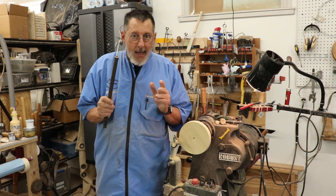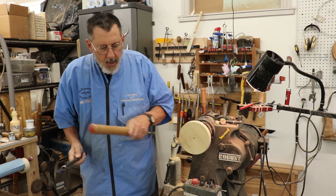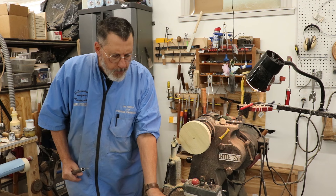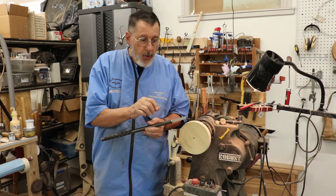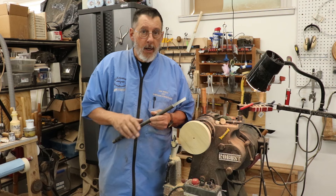When you're doing a spindle — let's say I'm cutting across this tool handle — the height of the kerf doesn't really matter. But when you're cutting across grain at an angle, that kerf is a little bit different, and your tool can bind in that. I'm going to make a cut here and I'll show you what I'm talking about.